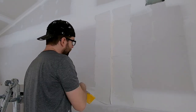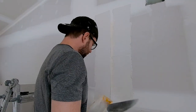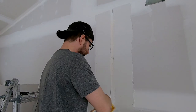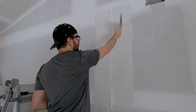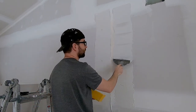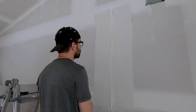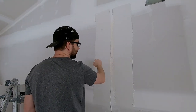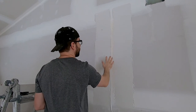This uses up a fair bit of mud, so I'm going to get some more. Then I'm going to do another pass right down it — just to smooth it out and get the right consistency so it's the same depth all the way through. You want it smooth. Now we're going to do the middle. The reason I do the sides first is that gives a higher platform so I can get even more mud down the middle.